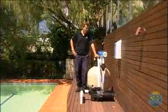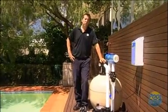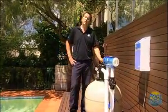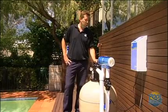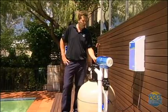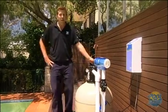The most common type of filtration these days is a sand filter. Most people like these because they're low maintenance and don't require too much work. However, every four weeks or so you do need to backwash your filter. It's a very simple process. One rule to remember is that every time you move the backwash handle, the pump has got to be turned off.